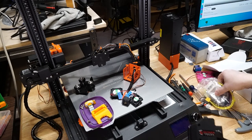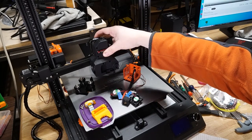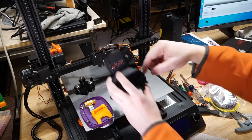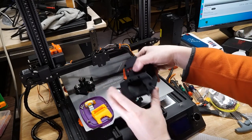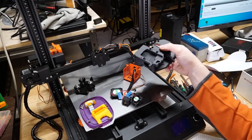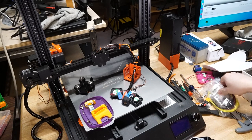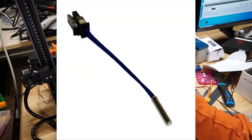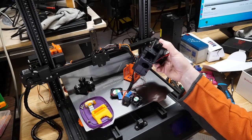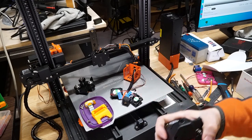The E3D V6 will go inside here and everything should bolt on top. The BL Touch mount, fortunately, because it was already on the right side, is going to be in pretty much the identical offset position. When it comes to firmware, the only thing that should have to be changed is the thermistor setting for the E3D, which is Type 5. Beyond that, I just need to do the E-steps and PID auto-tune on the hot end.